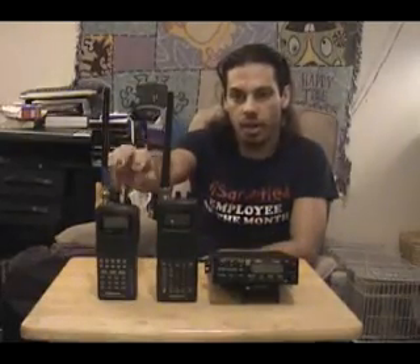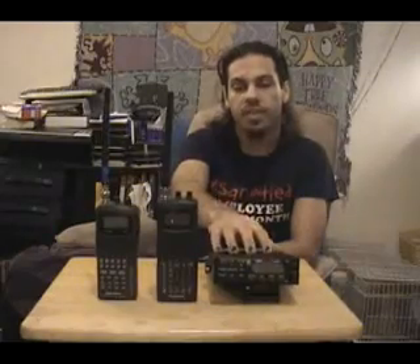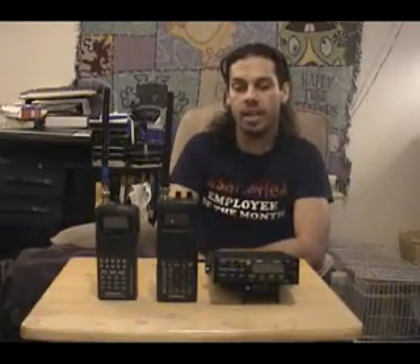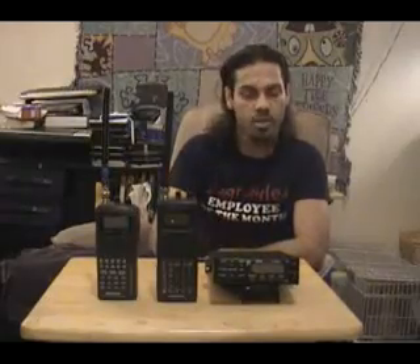The stepping is hard-coded into these two older radios, which means if you do a physical modification to them you might actually break some of their other functionality. Another thing to understand with radio scanners is that, just like any radio, you need the appropriate antenna. The wavelength is directly proportional to the size of your antenna. These are not transmitters, so they do not need 50 ohm coax — you can use 75 ohm coax, meaning the cable left by a cable or satellite installer can be used to connect your scanner to an external antenna.